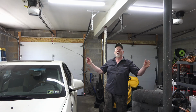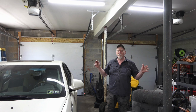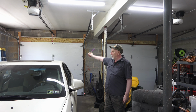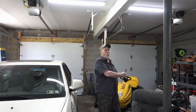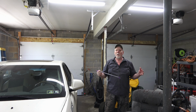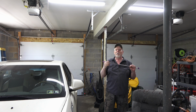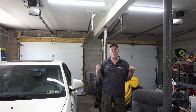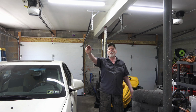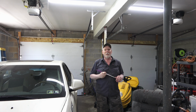I'm in the garage. They suggest not putting a smoke or carbon monoxide detector in the garage due to too many false alarms from vehicles running, lawnmower, gasoline equipment. Now that's a hard pill to swallow because there's 3 bedrooms above this. So the best detector in a garage is a heat sensor. I might go that route. I might install a smoke detector, and then if it gives me issues, I'll get the heat detector.